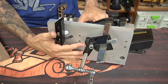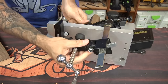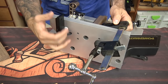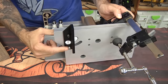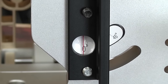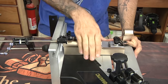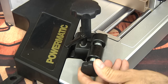We've got a nice wide work surface here that will support all different size workpieces. There's a clamping system that's very easy to move around to various locations, so you can get the clamping pressure exactly where you need it. There's a stop back here which can adjust to any angle you could possibly need, as well as a magnified gauge so you can return to various different settings. The jig is very easy to adjust from front to back, simply by sliding it along an angular path, and there's a micro-adjustment feature up at the front.